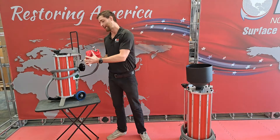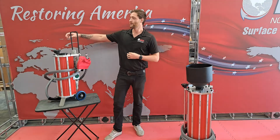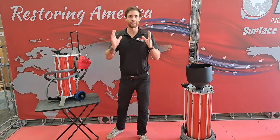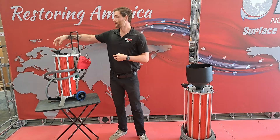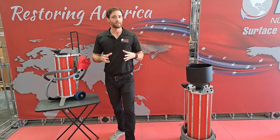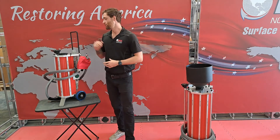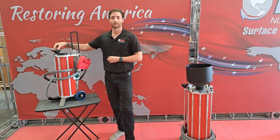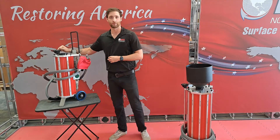Along with the standard gun and the helix gun, the main difference you'll see on these machines is an abrasive media adjustment. What this means is if you would like to lean out your media — maybe save yourself a little bit of money with less media — you can close this valve most of the way. If you want to open it up and get a little bit more production, just open this valve a little bit. It's very easy to do, right on the top of the machine with a dial that shows you exactly how much media you have flowing through.